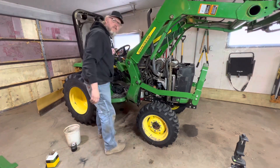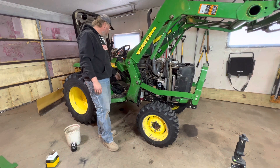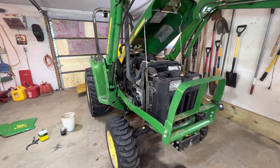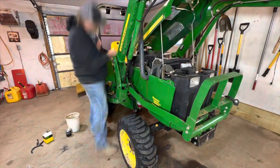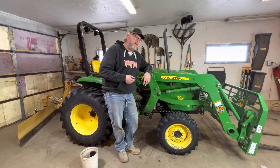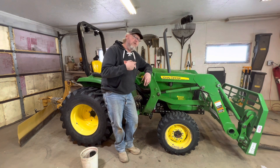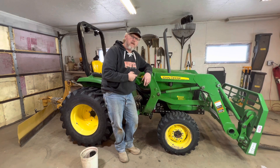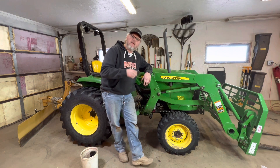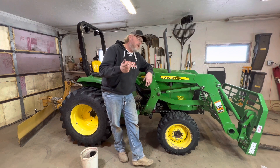Turn it back off again, then turn it back on and see if she'll start. After it's running initially, I like to turn it off and start it a second time to make sure there are no problems — and there aren't. At this point you can put your side cover back on. That's all there is to changing the fuel filters on a John Deere 3032E, late model 2015, serial number 610,000 or more. You do need to know your serial number when you buy filters for this machine. Quick, fast, simple, and easy. If this video helped you out, give me a thumbs up and maybe subscribe — thanks for watching!